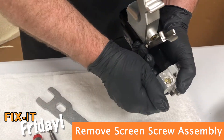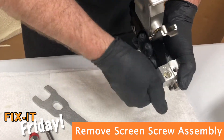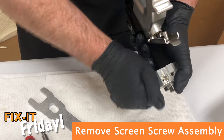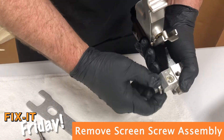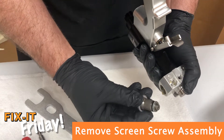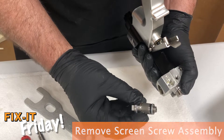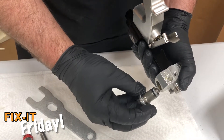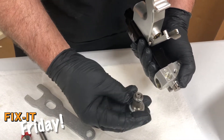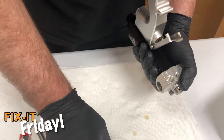Crack the screen open, keeping the gun in a down forward position. Even if you flush it, you can get cross contaminants inside the gun, which just makes the cleaning process harder. I'm going to remove it — it's just like the AP2 gun. Inside you have the side chamber, the O-ring, the support washer, the screen, and the spring inside. And of course, the seal down in the seat. These parts are reusable from your AP2 stock if you have that.